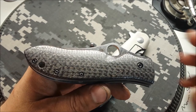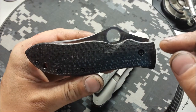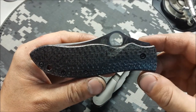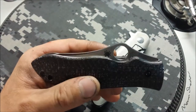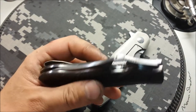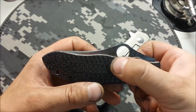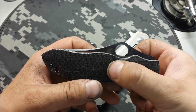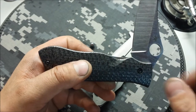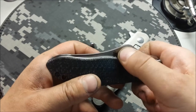So this gentleman wanted an update of those scales — he wanted full carbon fiber. We went lightning strike to go with the premium carbon fiber. Being full carbon fiber, we took the scales all the way out to the edges. Naturally, this knife is kind of shadow-boxed, so you see just a little bit of liner poking out all the way around, which made for an uncomfortable feel because everything had really hard edges — really bulky as well. And the liner covered up that thumb hole just a hair. It pretty much matched flush with the lock relief there.